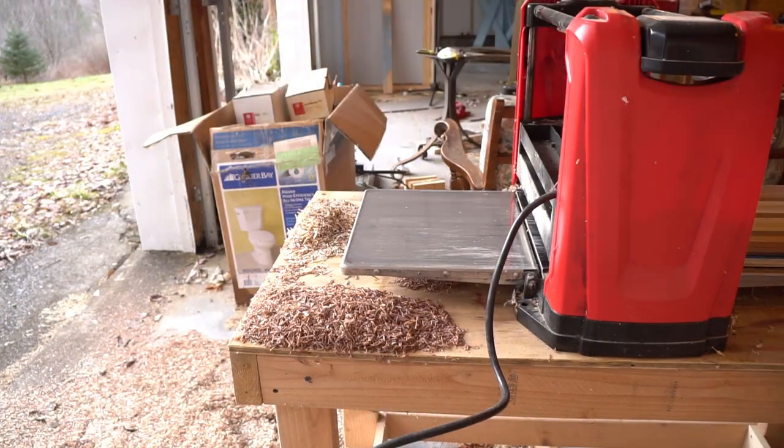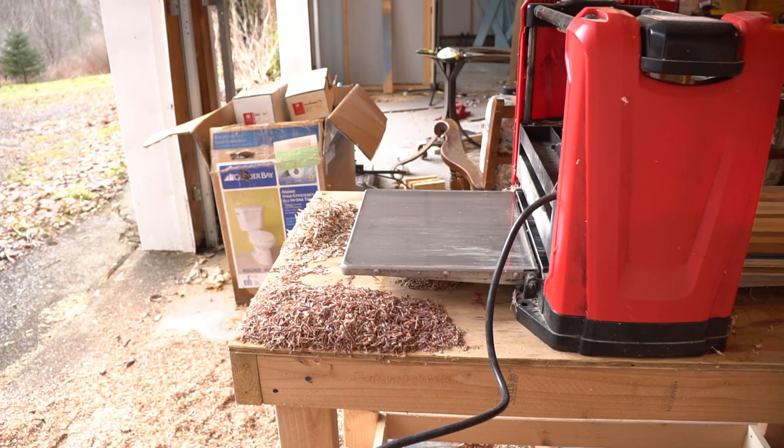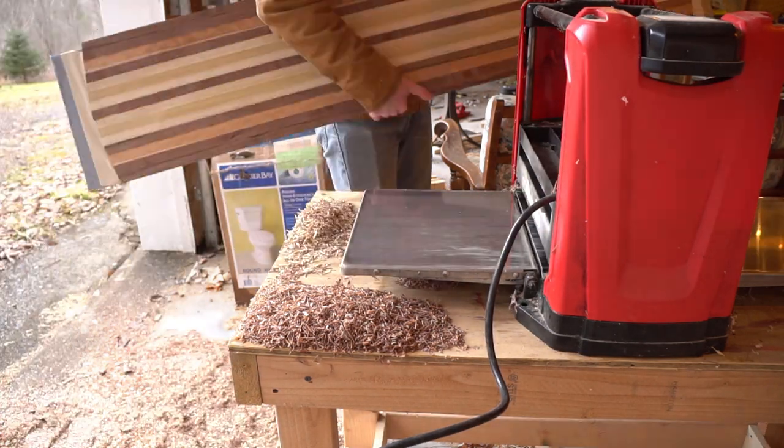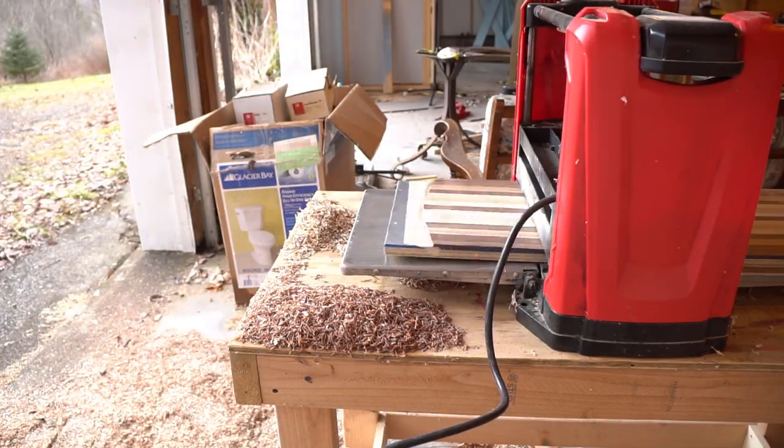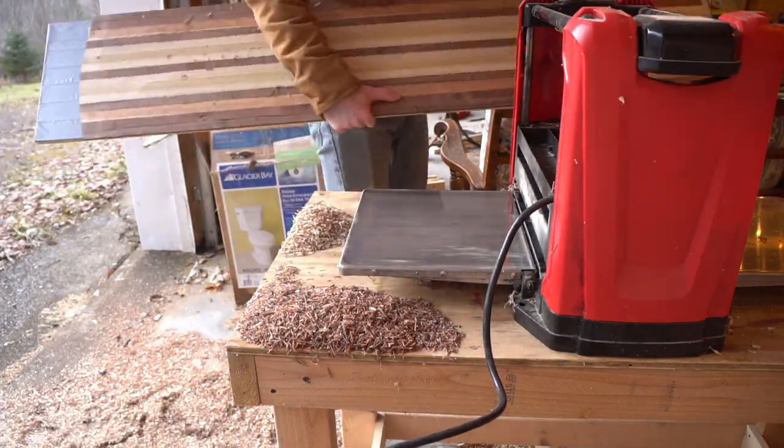The core is attached to the cradle using this cool double-sided masking tape stuff. I'll link to it down in the description. And then you run it through the planer until the tip and tail are as thin as you want them. And for my build, I'm aiming for just about 2 millimeters. I can tune it up later as needed.